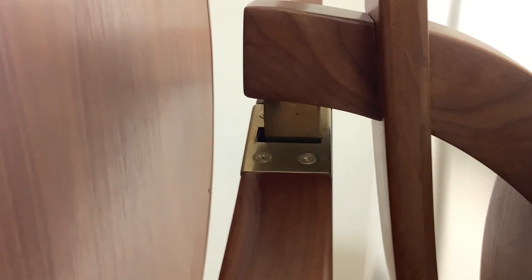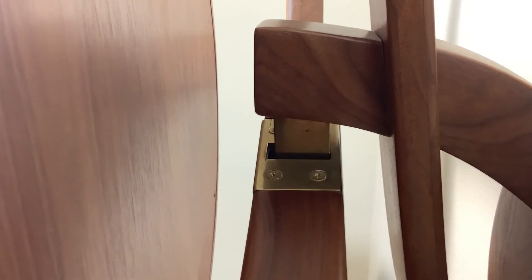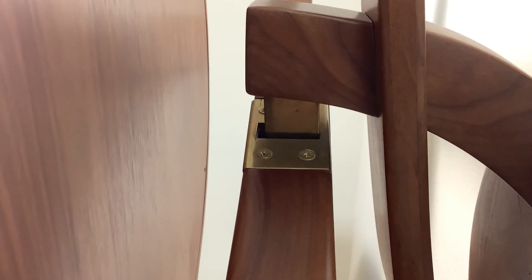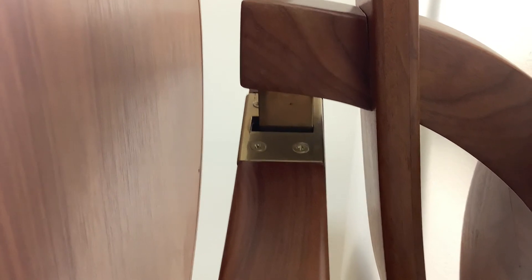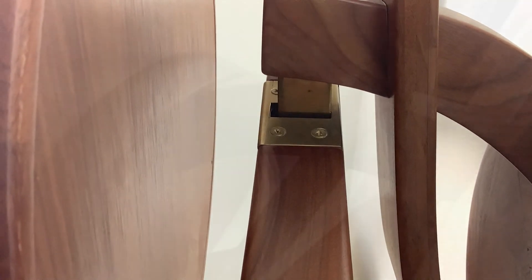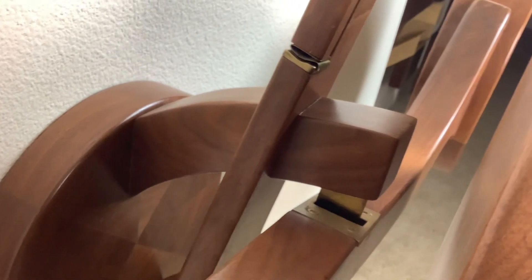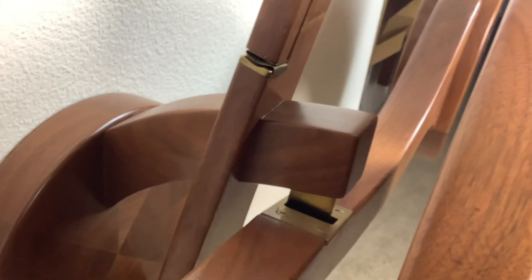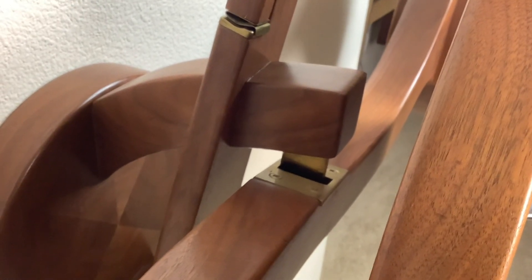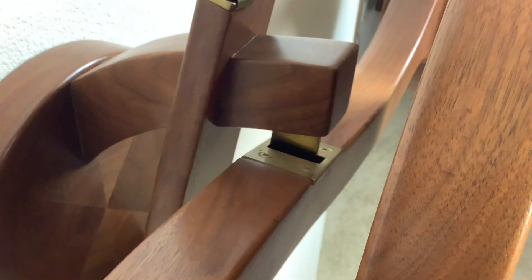During the six months after construction, two separate failures caused all of the pendulums to fall to the floor. First, the pivot in the middle of the first vertical pendulum pulled out of the mortise in the wall mount — apparently the epoxy did not set up properly because it was contaminated or too old. It was fairly easy to repair everything and reassemble the harmonograph. Then, a few months later, the first vertical pendulum bar broke in half at the pivot. The wood failed because too much wood was removed fitting the recessed plate and making room for the pivot parts. The bar was completely rebuilt using new wood, and the recessed plate was also redesigned to strengthen the bar at this pivot.